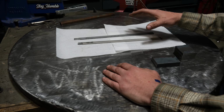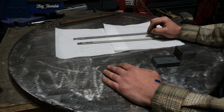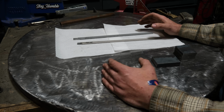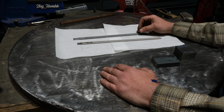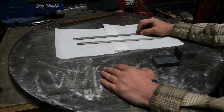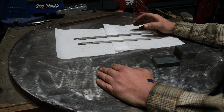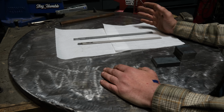But anyways, the common question, and I've gotten asked this quite a bit, is what's the deal with a 6010 root and a 7018 fill and cap? Now, in piping, that's very common. For example, I'm now a certified pipe welder, and for the last couple months, I've been cranking out a ton of 6010 roots, 7018 fill and cap on pipe, and it works great. It's been with us since probably prior to the 50s. So it's a great process. It's plenty strong depending on application, etc. You get the picture on it.